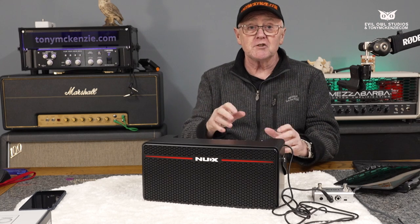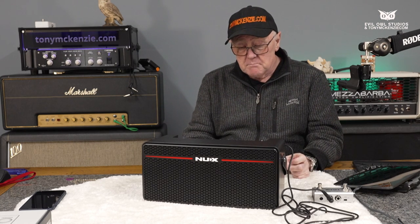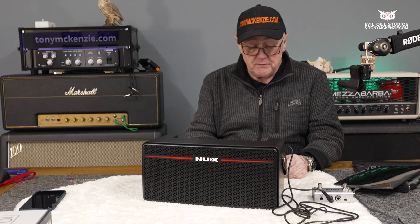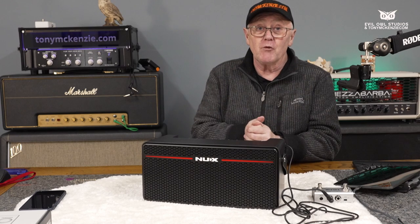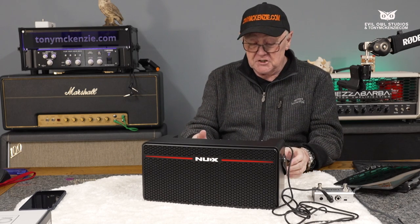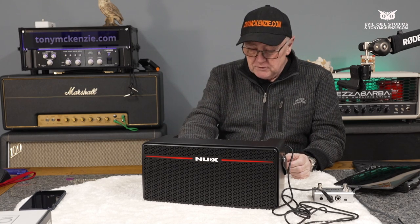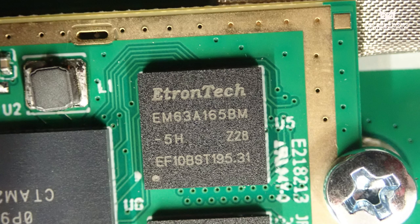Now, next to that processor, a couple of 16 meg times 16-bit synchronous DRAMs, or SDRAM. You will have heard the phrase before. It doesn't matter if you don't really know much about RAM. What's important is that this system uses it. And it's got quite a lot of features. Once again, we could harp on for hours about it. But it is a high-speed CMOS synchronous DRAM containing 256 megabits. It's internally configured as four banks of 4 meg word times 16 DRAM with a synchronous interface. All signals are registered on the positive edge of the clock signal, or CLK.